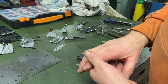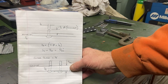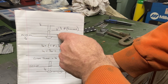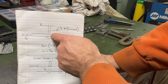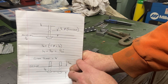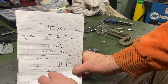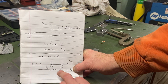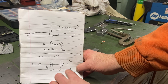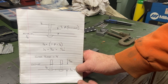The problem is because this is only a 16th thick material, I have to make sure I get the rivets the right size to get the heads to look the same on both sides. There is a formula — the material I've got is a 16th, and the normal rule of thumb is that you have one and a half times the diameter sticking through to create the head on the other side. With the cutter blade at an eighth, if I put it in at the cut line the rivets would be cut off at an eighth, so that's why I've got the shims — I can put a shim underneath to jack the head off, and when I shear it the rivet should then be the correct length.